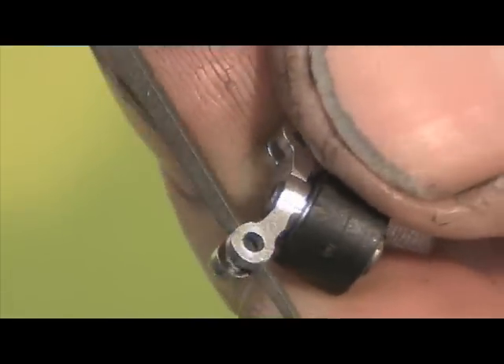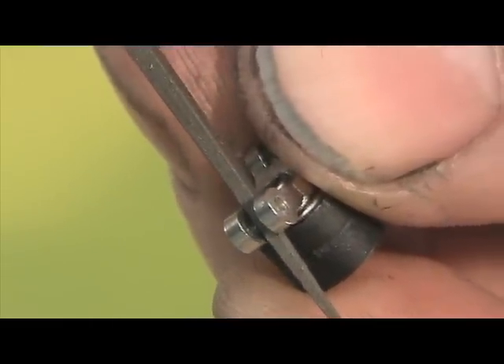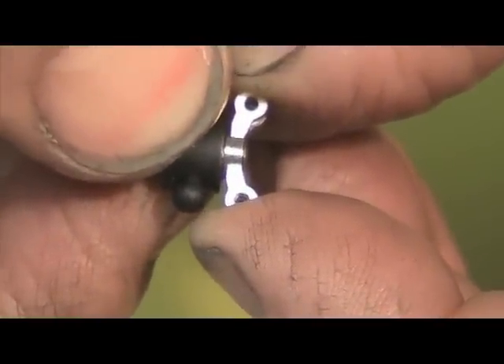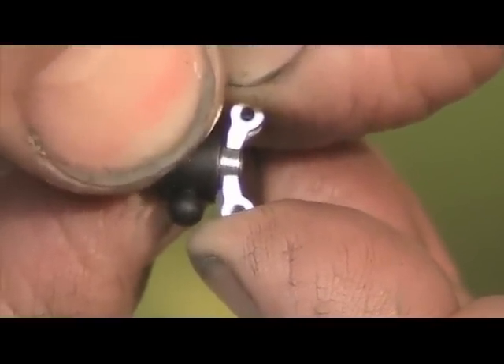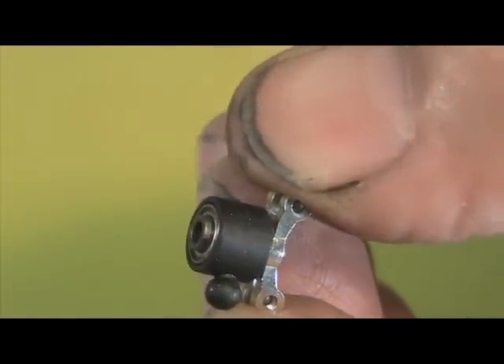With the needle file, make sure you don't hit the faces where the bushing is going to touch — just relieve it probably ten thousandths and you'll be good. That would also be a good time to check the play in your pitch slider bearings. This one has a little slop — I'm going to adjust that out with a three millimeter wrench and some duck bill pliers.